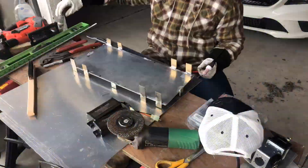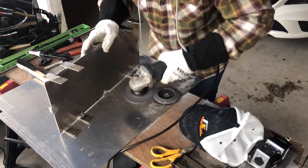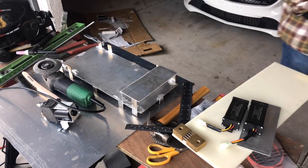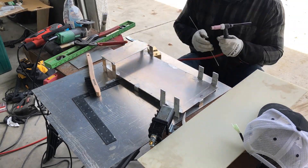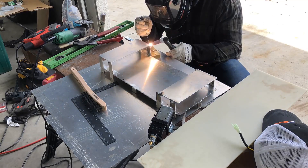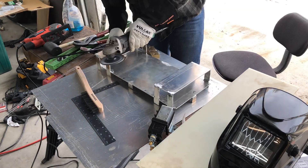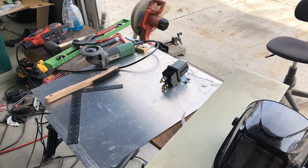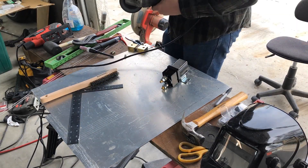I started attaching the platforms to the posts at the correct heights and adjusting the locations for each component. It was trial and error to find the right spot for the shunt and contactor, figuring out the best ways to keep those wires isolated from each other so nothing would short circuit, while also making everything fit underneath the tank lid. Then I cut out a slot and attached threaded rod as studs for the controller to mount onto.